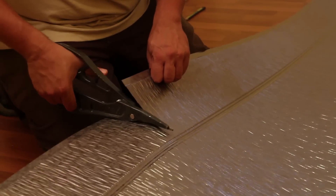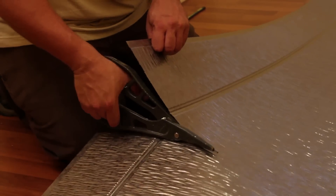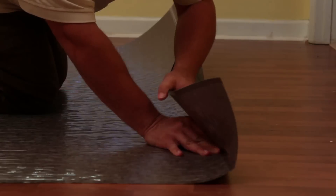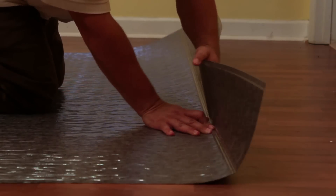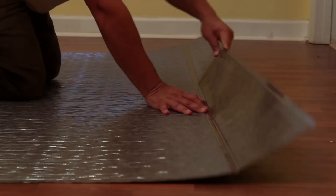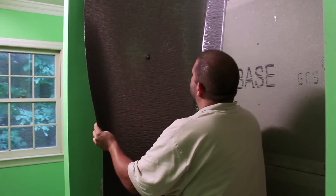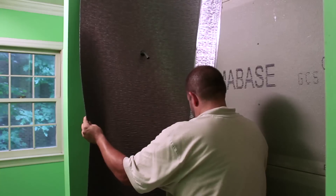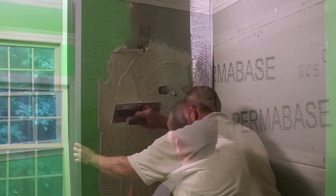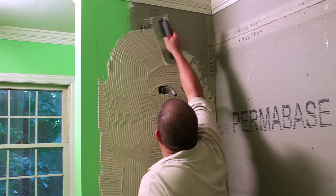You will see from the instructions that the side panels have folding corners to eliminate the chance of water intrusion. Pre-bend both side panels to approximately 90 degrees according to kit instructions. Before gluing, lay up the panels in place to make sure they fit and that the hardware cutouts are correct. Now you are ready to install the side panels.